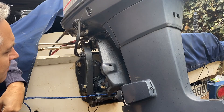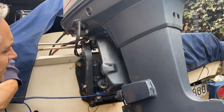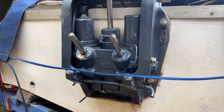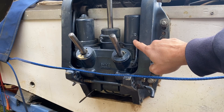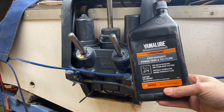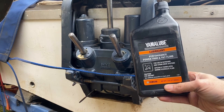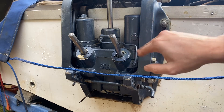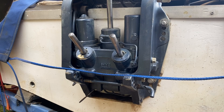However, if you can actually hear that motor running going up and down, the next thing to check is the fluid level in the reservoir. To check the fluid level you're going to want to take that nut off the reservoir and check the level. You're going to want to top it up with the proper Yamaha Lube performance power trim and tilt fluid. The easiest way to get that in is with an external bottle, because otherwise you're trying to pour it in with a funnel. I've made a whole other video on how to fill the tilt trim on a Yamaha outboard so I'll link that in the description.